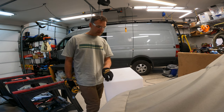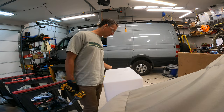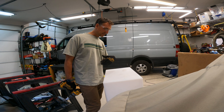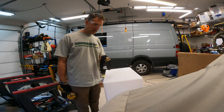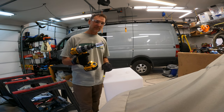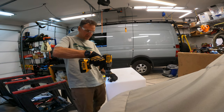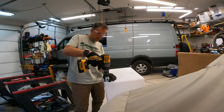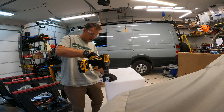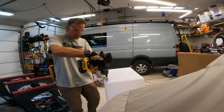Once you drill the hole, it's going to go right in there. One thing you may notice with this tank — it's very bulbous, bowed out on all the walls, particularly the longer walls. That's because when it's spin welded, there's a lot of hot air that gets trapped inside the tank. Once I put this hole in here, these walls will start coming back down and settle out over time. So I'm just double checking the size and my space that I've marked here. Make sure everything looks just right and it's in exactly where I want it. Always measure at least twice and hopefully only have to cut once, particularly in a custom tank.